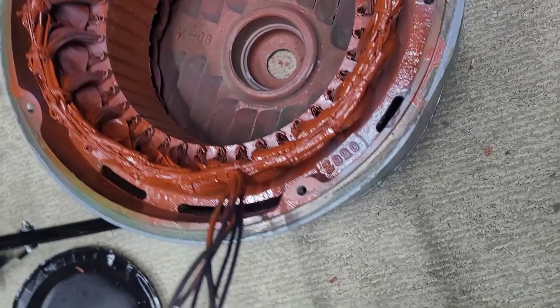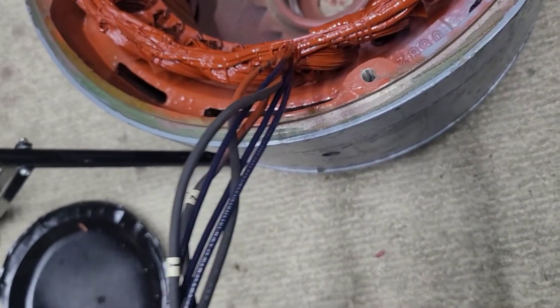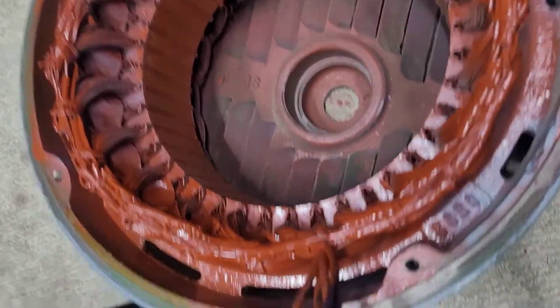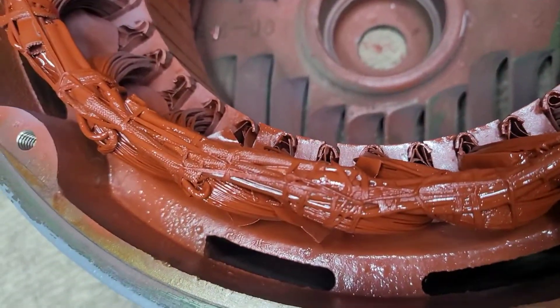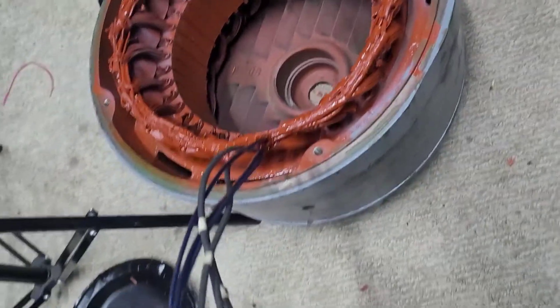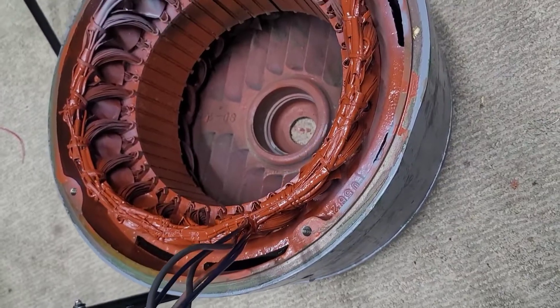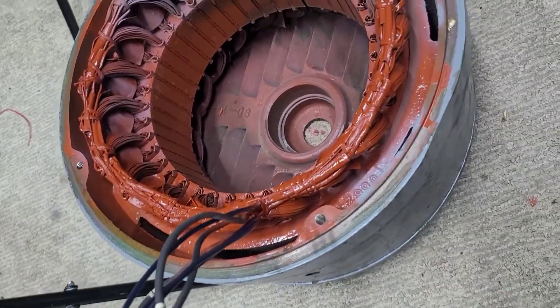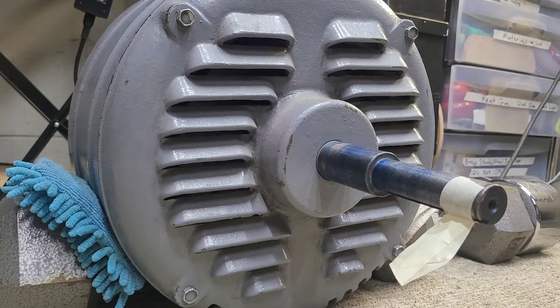Here's what the job looks like after I've added the three new leads. They are the same gauge wire; the insulation is just a little bit thinner on the ones I added compared to the old ones. I sprayed it with some red spray varnish, which is actually what the motor already had, so it kind of blends right in. Right in here is where the new joints are — you can't even really tell. I'm going to test it with the ohmmeter to make sure everything checks out and also do an insulation resistance test, then we'll fire this thing up.